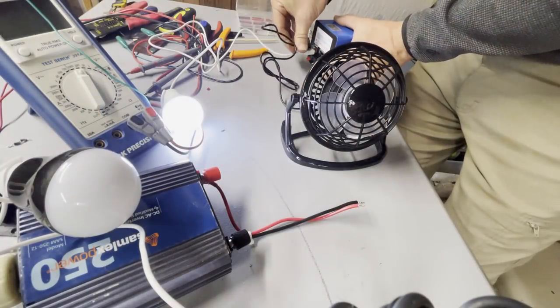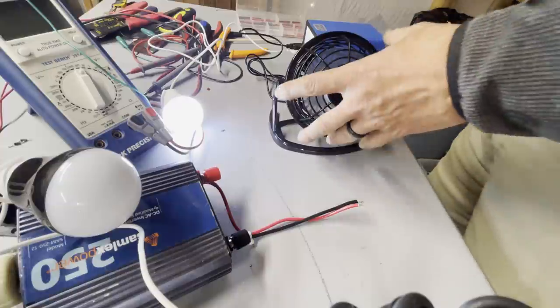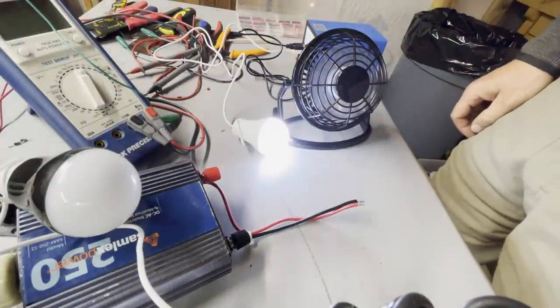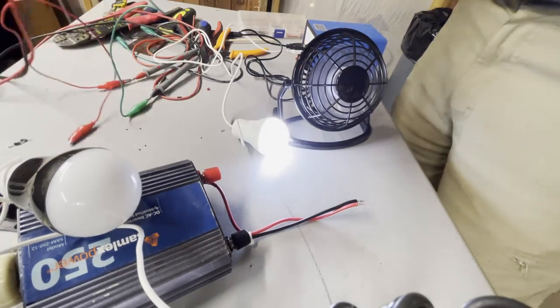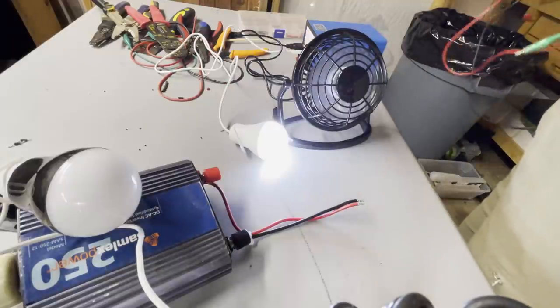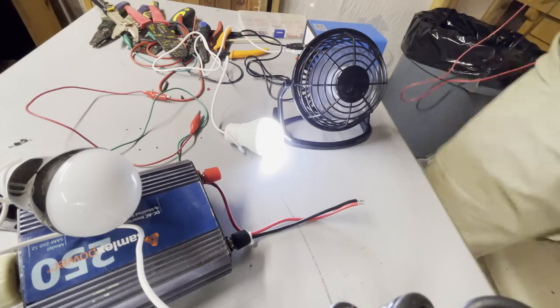Where this system really shines and has very practical value is when powering these USB-powered devices. This works really well because you can charge the supercapacitor power bank up to 15 volts. However, the USB port on the front of the device is regulated to 5 volts. This gives you a wide voltage range to draw the energy from and gives you a very nice long runtime